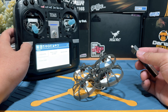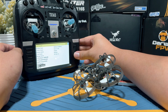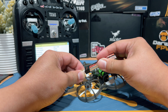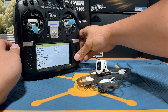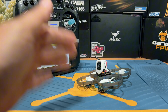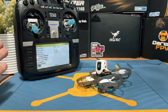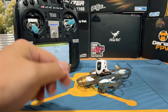Go into the system, go to the ExpressLRS Lua script, and scroll down to bind and hold it there. At the drone side, plug and unplug two, three times, then plug it in a fourth time. This puts the drone into binding mode and then you just hit bind. You can see that they are connected together. If not, check your radio firmware — it has to be both on version 3.X in order for them to bind. Now let's move to the PC to finish the setup.